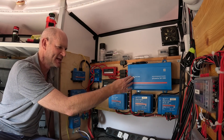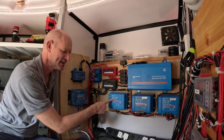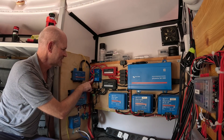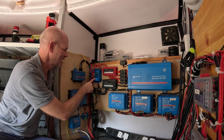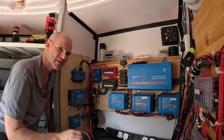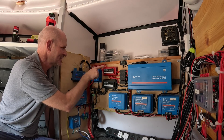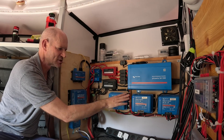I've got the inverter for supplying the AC systems, the two 12-volt power supply units for the various astro equipment, and the battery charger unit for feeding the shutter charger battery. What I should have done was take a direct feed to the fuse of the inverter, and then only use the output of the smart battery protect to feed the 24-volt system out to the fuses for the various components.